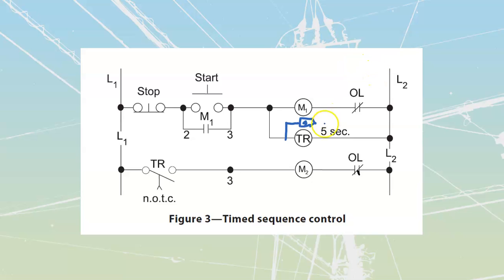Usually what this is going to look like is that somewhere on that octal base, if it is an octal relay, that's an 8-pin relay. If we had something that looked like that with the octal base, usually we're going to have 2 of these that are going to be my coil, my power, and then usually one of these that's going to be my signal. Usually it seems to be this one that sits around here on the side over there, number 3.